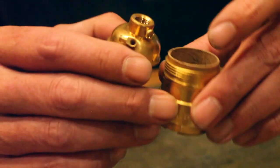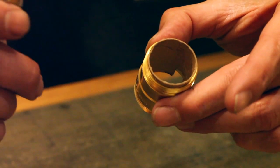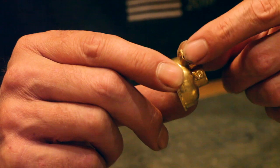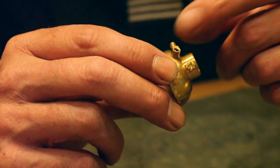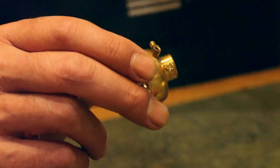It's isolated so that no connections will touch the base by virtue of this cardboard cap, which is probably safe, but not as safe as it could be. So we're going to create an earthed version of this. So this is actually an earth tab, very similar to our bayonet or B22 system. It's just a connection to the outside. So we're going to connect the ground wire to this.